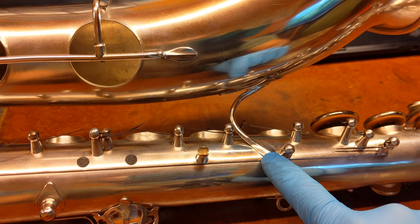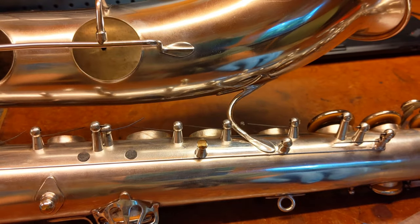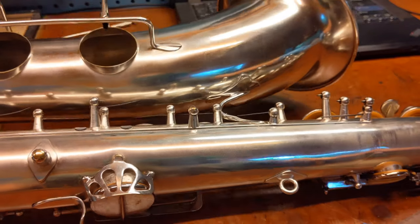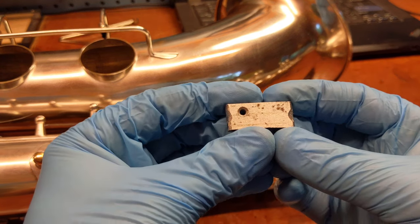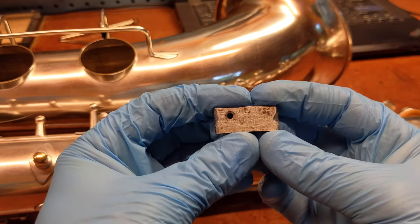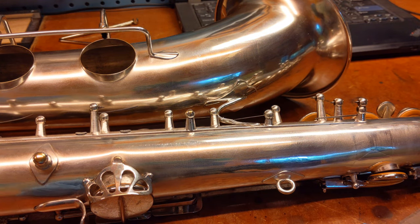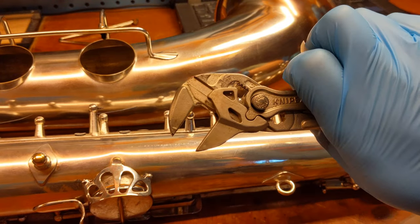What I want to do is fix that without having this peel off — these always come off right here, and on silver plate it's difficult to have it look like it should. So I'm gonna see if I can fix this without soldering it, which means not putting any pressure on this particular spot. I made a little widget — just a piece of steel with rounded edges, a little dent on either side, and some Teflon that's thick enough to be strong enough.